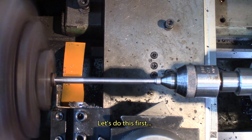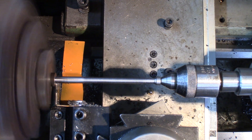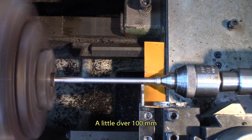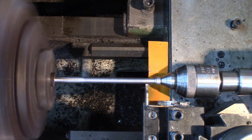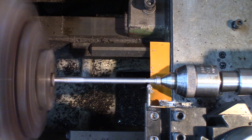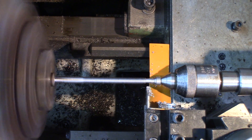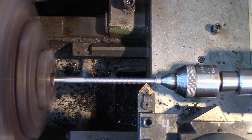As a last operation on the blank as it is now, I need to make the shoulder. I eyeball the measurement — I need four inches of clear thread, so let's go to four inches. We're cutting a little bit under minor diameter, and making it long enough so we can operate easy. We want to chamfer this to make an easier entry on the screw.